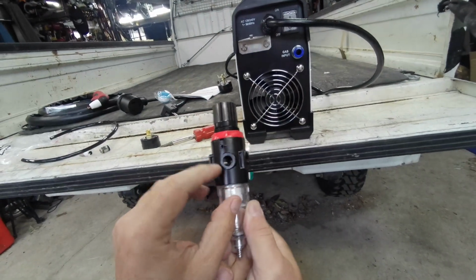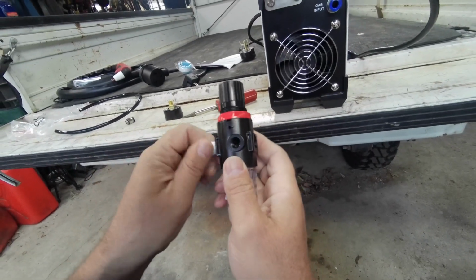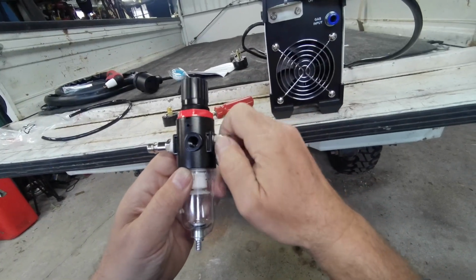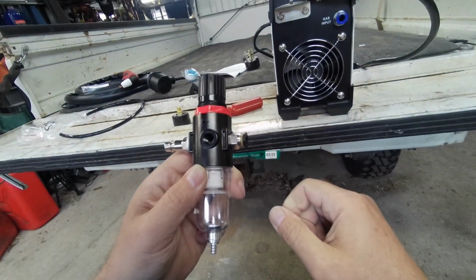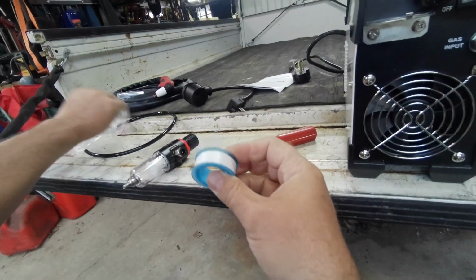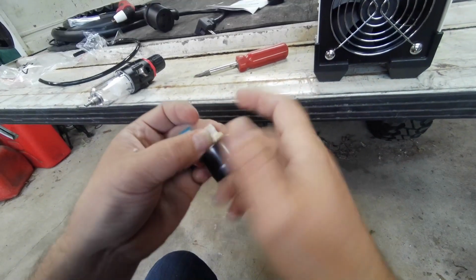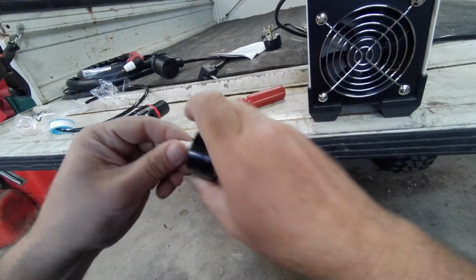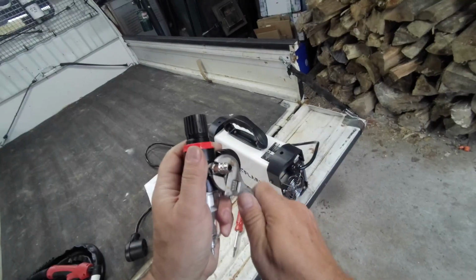This regulator has an arrow, as you can see. So the input from the air compressor is on this side. This quick connect is on the output side on the right. It has a little O-ring, so you don't need any Teflon tape, but this gauge will. It's pretty thin stuff. Don't cover the hole. I'd probably go around 3 or 4 wraps in the direction that the thread's going to go, of course. You all know that, though.